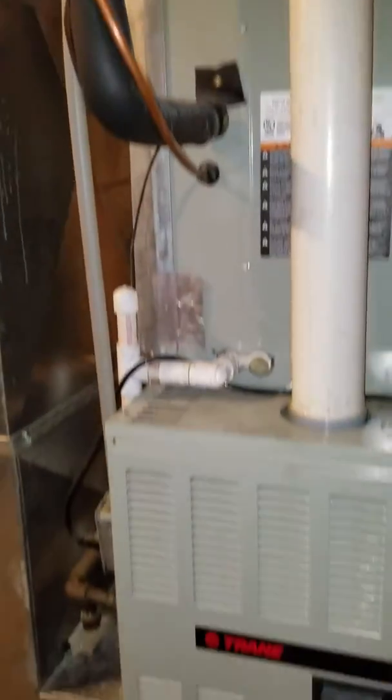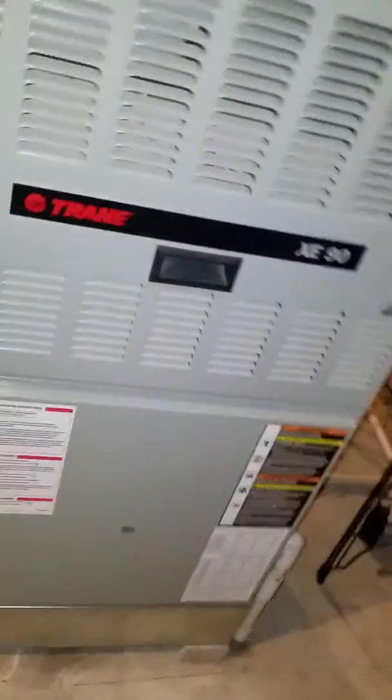Here's the top. This box on the bottom is 6 inches tall, which isn't really doing a whole lot the way it sits, because the air doesn't even get to the bottom of it. We do have a large return that comes up and goes this way, and it's panned on the rest of this. All your ductwork is in great shape, runs out this way.